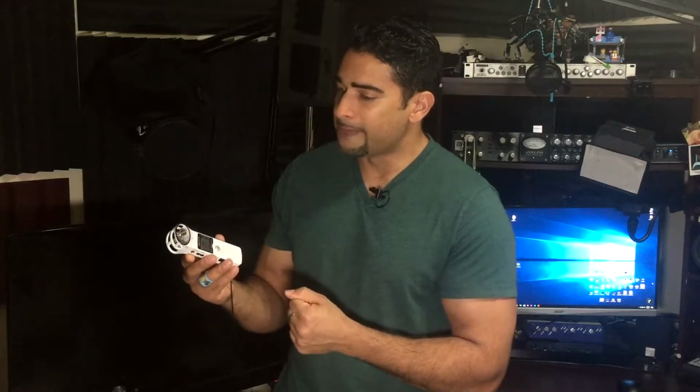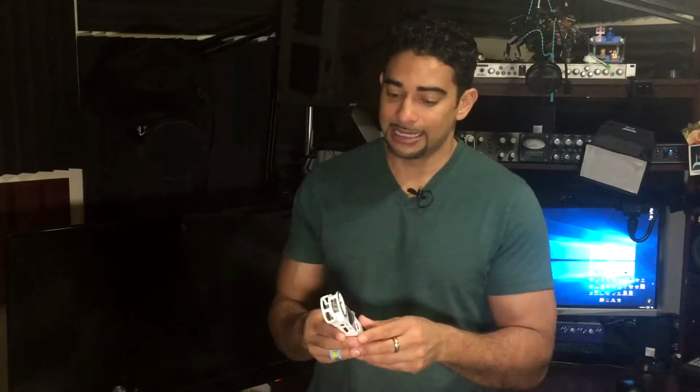I think right now, since I'm recording at 48, I have a 2 gigabyte memory card on this. It takes up to 32 gigabytes, but I have a 2 gigabyte card right now. And when I put on 48,000 hertz, 24 bit, it gives me like maybe 2 hours of record time. If I were to throw this into MP3, at the highest MP3, 320 kilobits, it gives me like 13 hours. So, the space is different, but of course you have more information in a WAV file.